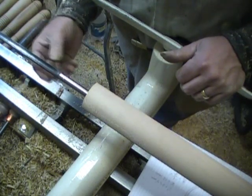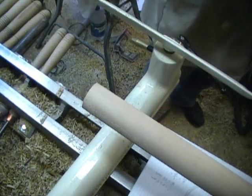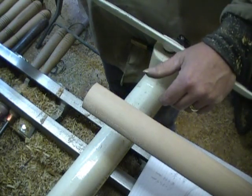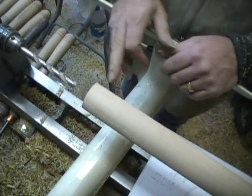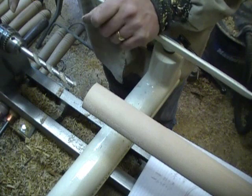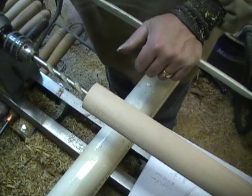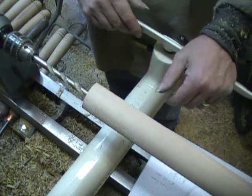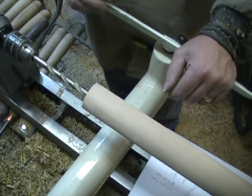How about that? That will go in a 15/32 hole. Now, according to my conversion, it probably shouldn't have, but it's entirely possible that there's enough alignment error between the headstock and tailstock that the hole is being cut slightly oversized to what the bit is. Or it's also entirely possible, since this was a fairly cheap set of bits, that the bit is a little oversized from what it says it is. Regardless, it seems to fit.